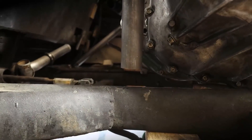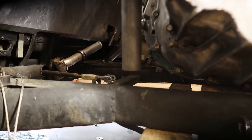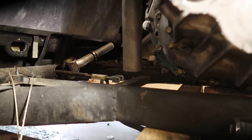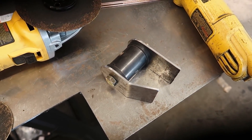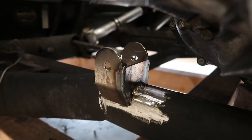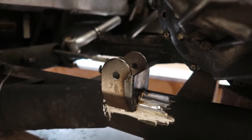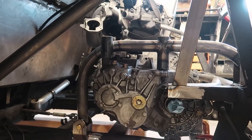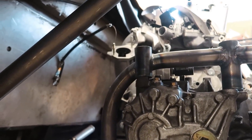On the other end, we need to put another bushing situated on top of the chassis itself. My solution was to take that CAD bushing bracket drawing one more time, modify it so it didn't have a back end, and then bend it up in the brake so it fit the chassis and offset the bushing in the correct direction. With it welded into place, it was just a matter of coping the tube — and here you can see a finished and complete transmission mount.